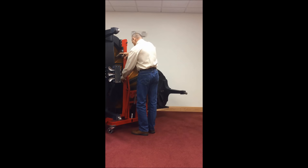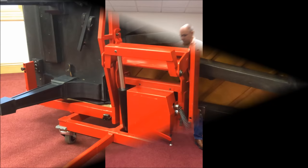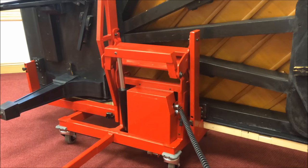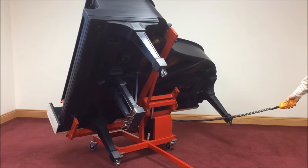When the piano is in its new location, the process is simply reversed. Install a balancer leg into the base and remove the slack. Check and verify that the piano has not shifted in the move and that the cradle pads are all located in their desired positions. Also check to be sure that there is no interference between the leg and the base on the way down.